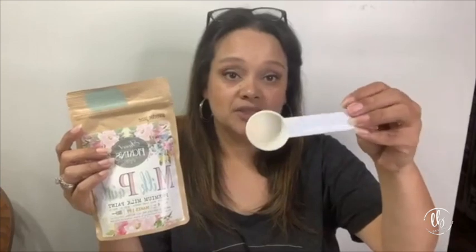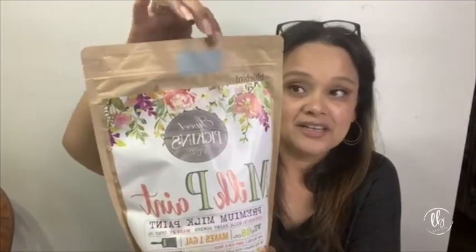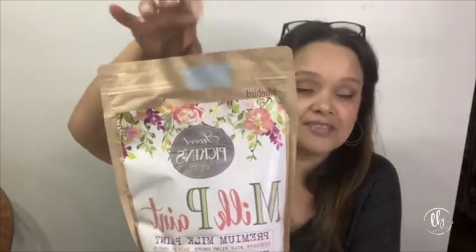A disclaimer: a pint of DIY Paint goes way further than a pint of milk paint, just because of the nature of clay-based paint — it's thick and you can water it down 10 to 1. The recommended mixing ratio for furniture is 50/50 — one scoop water to one scoop powder. I usually use a two-tablespoon scoop, or a one-tablespoon scoop, one-to-one ratio with warm water. And here's the big one — a gallon! This color is Bluebird, which is what I'll be using today.